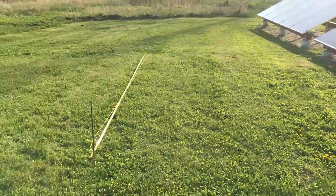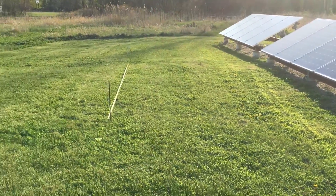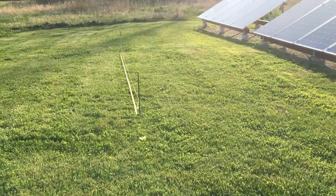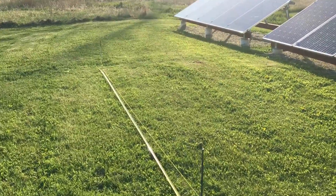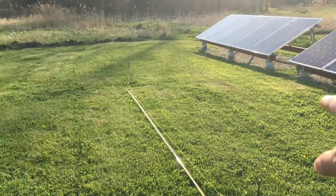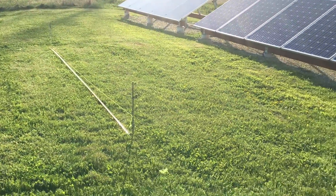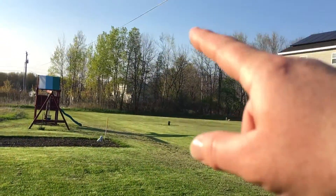These are my first measurements — they may not be permanent. Tonight I'm just laying out some rebar for basic measurements, and then I'm going to paint the whole area so I can have dig safe come out and make sure there's nothing in this area.